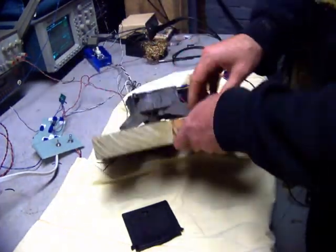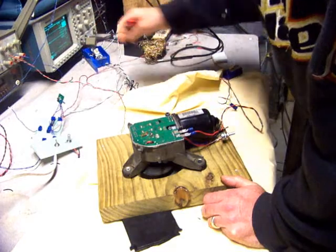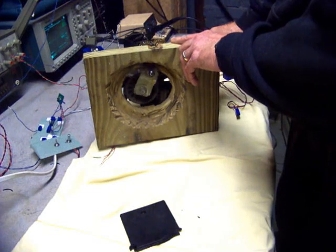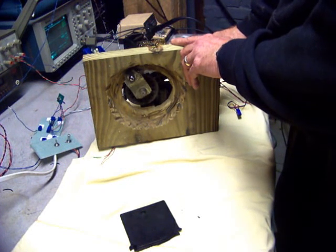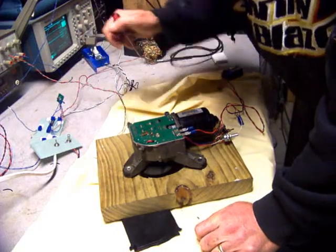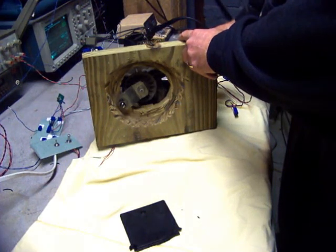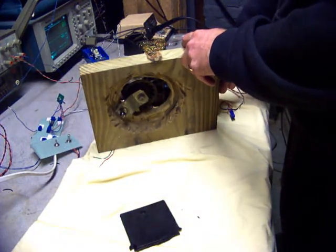There's a mode zero — it starts off as just a plain RC servo, so the potentiometer here controls the position. This is similar to how you'd control the position with a computer as well. There's also a mode — I believe it's mode 1 — where the potentiometer controls the speed. One of them has a switch here for forward and reverse. There's another mode where forward and reverse is on a single line.